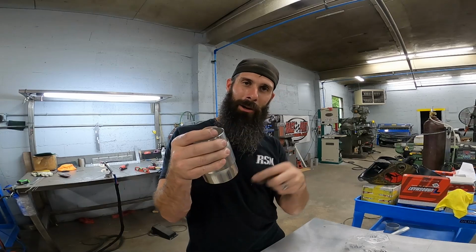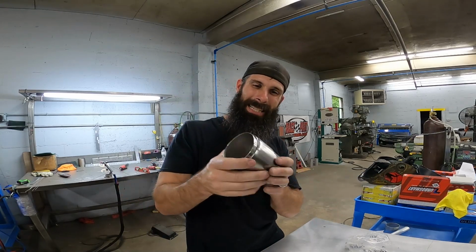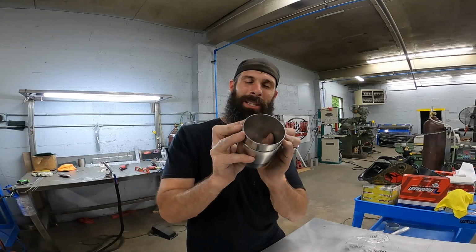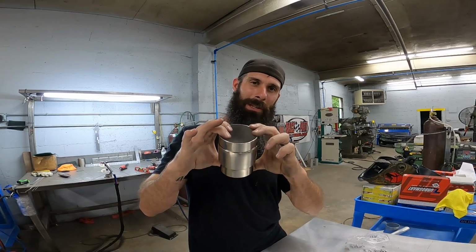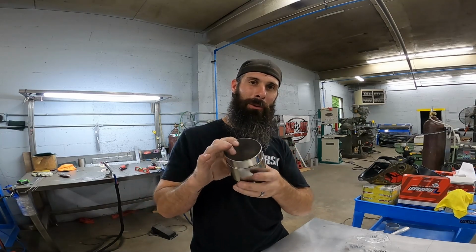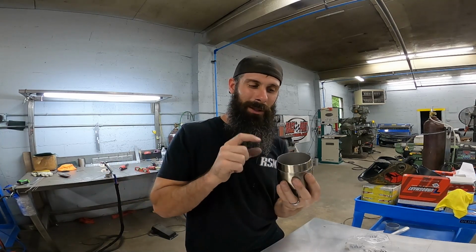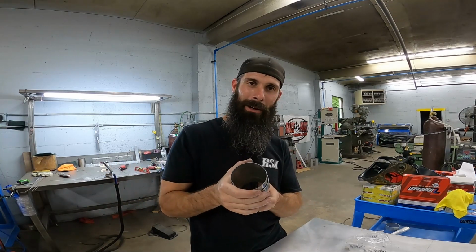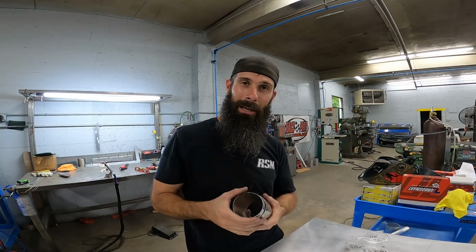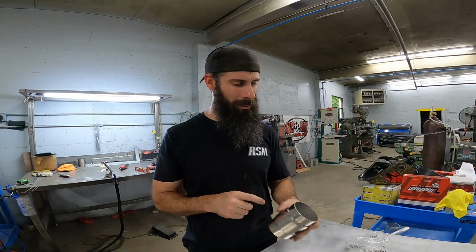I do that to allow for expansion and allow for me to move it. If I do it that tight and wedge the thing together, there's no movement there. There's movement side to side, but there's no front to back expansion room, because you put it as tight as it can possibly go. So leave just a hair of play in there to allow for the expansion and fit up. So that's just a little lesson on those.